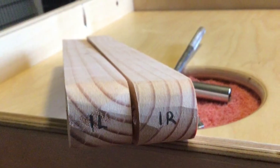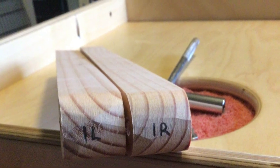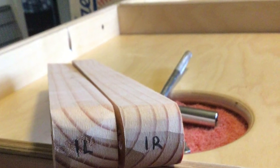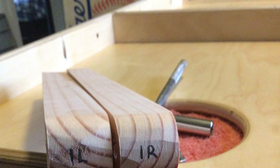When you're first starting out you might have a little warp to your frame or your decks and that's normal, but you'll get over that. What you want to do is label your legs so that when you cut them, if they're different lengths, you can make sure that they're in the appropriate spot. I do 1L and 1R and I do 2L and 2R.